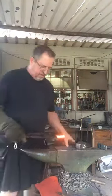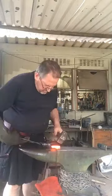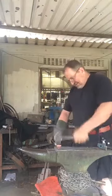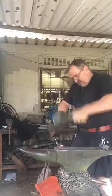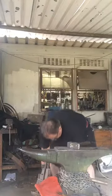So there's our piece of wrought iron. I'm going to forge that step down. The marker is over here, that chalk. I don't know what it's made of, but it sure takes the heat. I'm going to get it on the edge of the anvil. Hit it, pass on half face, step it down. So I hit it from this side, step going, like so. So it's stepped down. Now I want to just thin out that part.